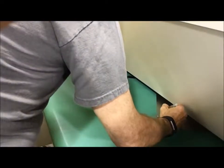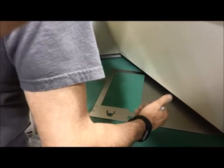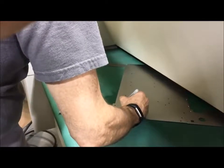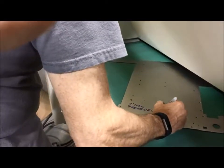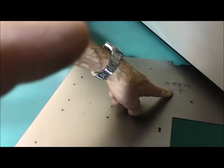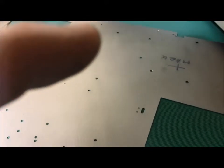So this part is 2 feet per minute, which seems to be slow, but if you run part after part, it's still over 100 parts per hour. And the pressure now here was average. And you can see that where we marked it, it's a little bit duller, but it's still fully visible. That's how little material we remove from the surface.